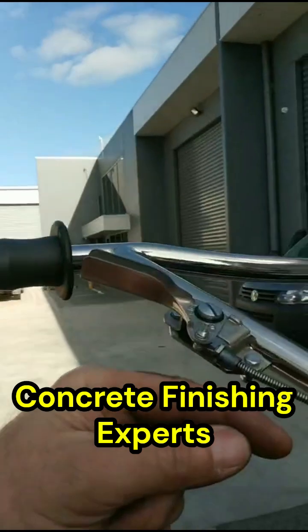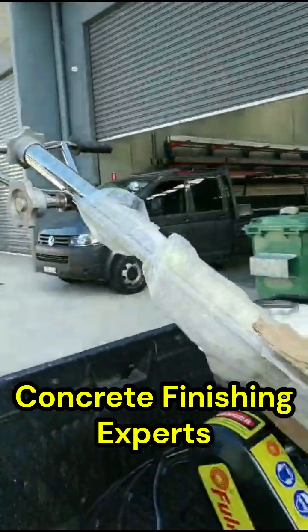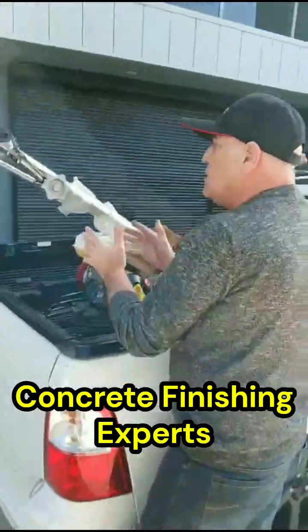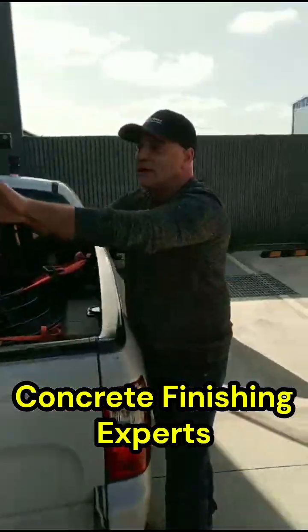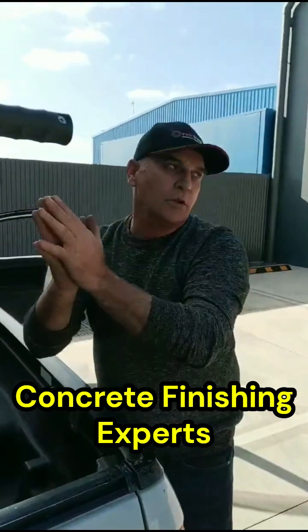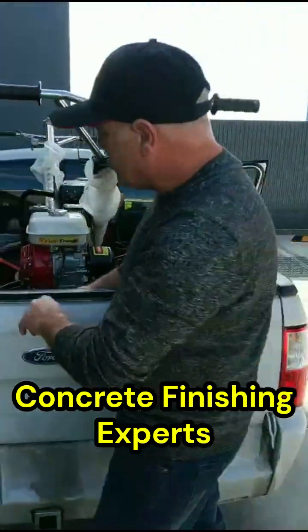The total cable is completely made out of stainless steel. Inside is a Teflon coating, so it will always operate smoothly. Why do we need this? Because in our machine we have variable kinds of ground, full-track movements. This is why it always needs to run smooth. And honestly, we never need to change it, unless maybe that hook is damaged.